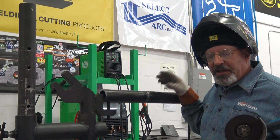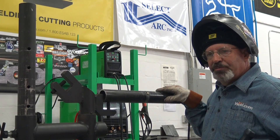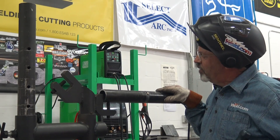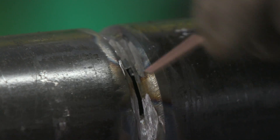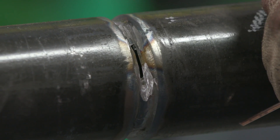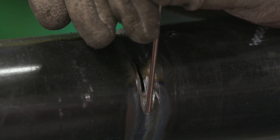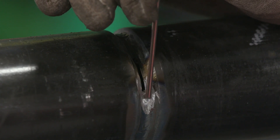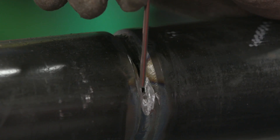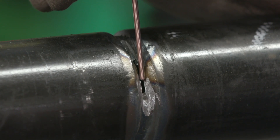I'm coming along here and I just made the classic schmoo move and dove right into the bead — it happens. I'm pretty comfortable with this. I have feathered the tack up here on the leading edge and I've taken care of my tungsten dip down here. I feathered it back into the good part of the bead — this is thinned out to just a burr. So again, I'm gonna start low into the bead here, not add any filler wire until I crawl up. This is gonna heat up and probably open up in a keyhole, and that's where I'll interject the wire into the groove and try to keep right on going.